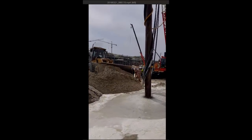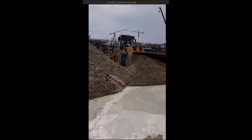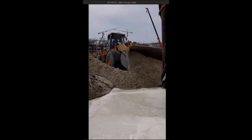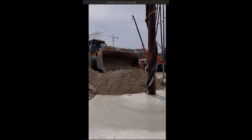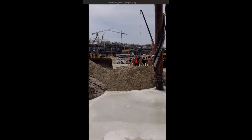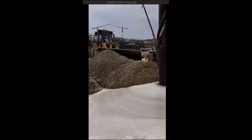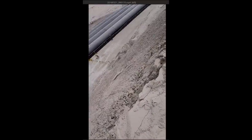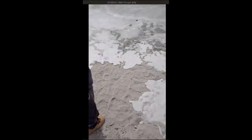As you can see, it is now going deeper and deeper, so the excavator has to push the soil through, because it is making a hole. If you don't put soil in as a placement, there will be no column. You need it as a column of soil, which means it will be stronger — that's why you're doing compaction. The lifts, as you can see, are either time-based or ampere-based: either 40 seconds or 420 amperes. The faster the compaction, the quicker it is done.